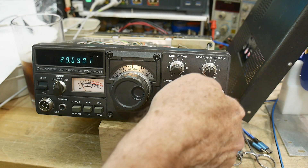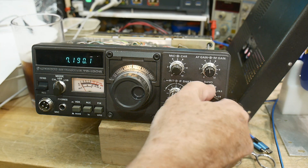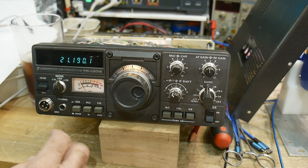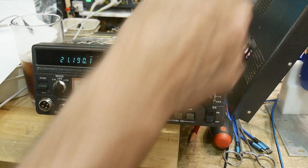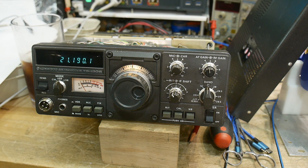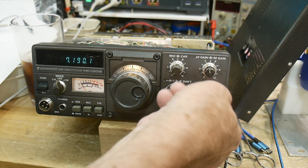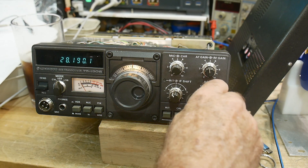It is now working. To fix it, I was poking around with my oscilloscope probe and found way deep inside those wafer switches back here there was a connector I had forgotten to put back together. I plugged the connector back on and we seem to be up and running. It gives a digital count on all frequencies.